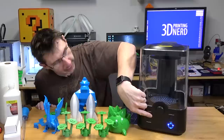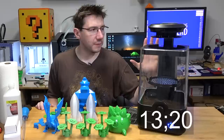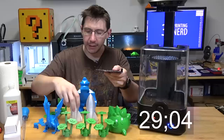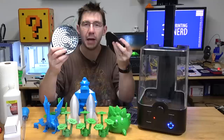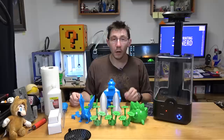The lights start to come on and everything looks cool. There's a button here that opens it — this clear plastic housing has little gaskets to keep the isopropyl alcohol inside. A mechanism lifts a platform up from the depths of the machine, allowing you to place your model on it. It comes with two plates that have little conical structures so the model sits on them rather than flat on the plastic. The plates are removable, so you can smooth one model, let it sit, then swap in another.